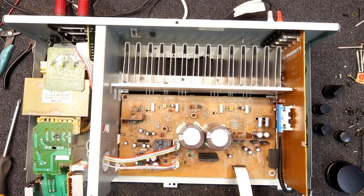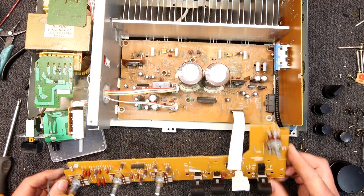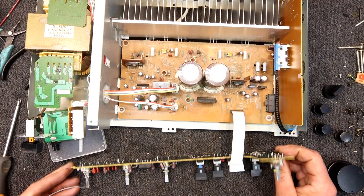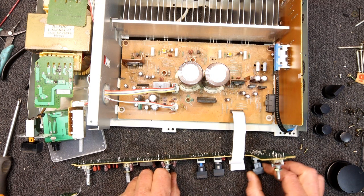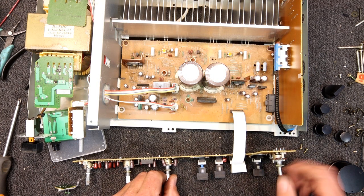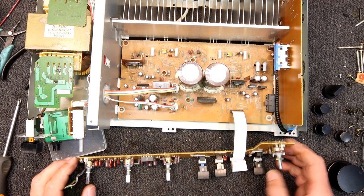Power on — we have our LEDs on. There goes the speaker protector. I'm probably off on one channel. Okay, power LEDs are on. This front panel is safe to touch as it's all low voltage stuff. If I put in the source direct switch we get a couple of orange LEDs lighting up. I'll turn the volume up — currently both channels are fine, no distortion. Even when I touch that switch it's fine.